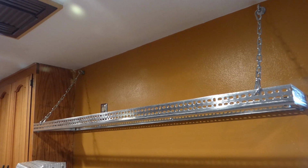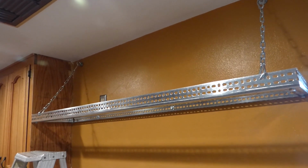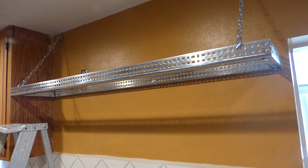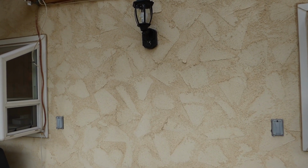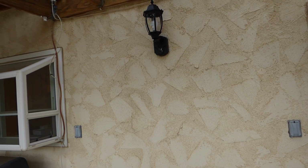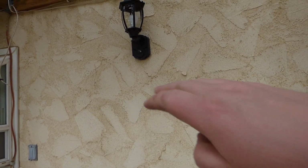The next we'll be doing is get ready to mount the hoods. So I'll have to take some measurements and see how we're going to do this. I have a feeling though that we're going to duct out from this wall here through the back. So I'm going to figure around the back and see what that wall looks like. And make sure there's nothing there, which there wasn't earlier. So back here, and just by looking at it, we know it's going to go between these 2 windows here, and there's a light there. On the back side of that light is pretty much the power box around there to where you saw that plug when we chinned the plug out inside. That's the receptacle, like, right behind that thing. So nothing is in this area here, and that is where the vents will be popping out.